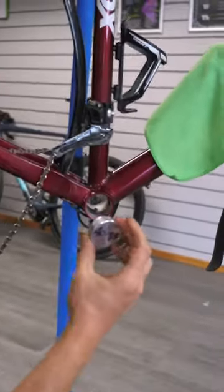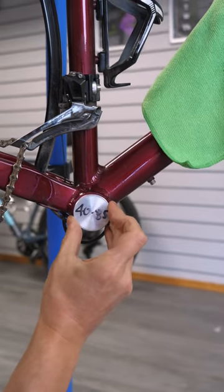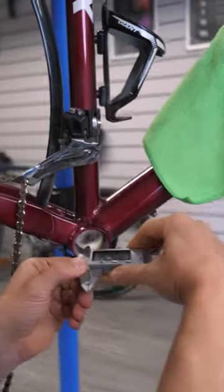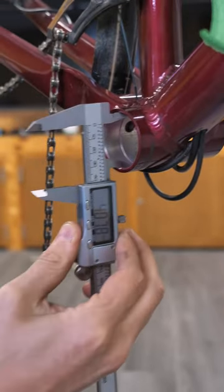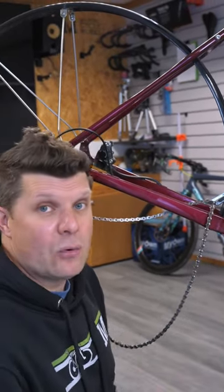When we take our little 40.85 gauge, you can see that it doesn't fit into this frame at all. Now this should be a 41 millimeter hole, and when we measure it we have 40.67 and 40.84, so we have a little bit of an oval going on — probably because this is warped in the welding process and it hasn't been faced. We can tell it hasn't been faced because of all that paint overspray.